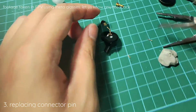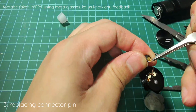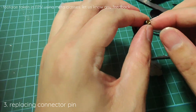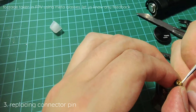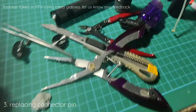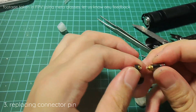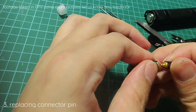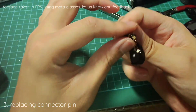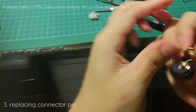I'm not too sure if it's still hot, but this will enter. From here we will try to straighten it and align it. The way we do it is to use a set of MMCX male connectors to do the alignment. I've just found any set of MMCX — we want to align the center pin to the center pin. We'll press it in. So this is the length we want.